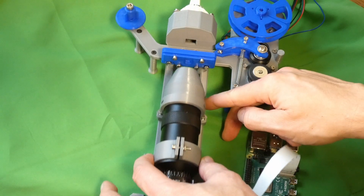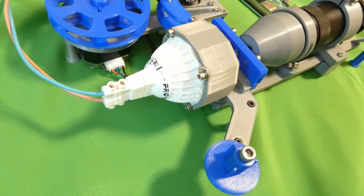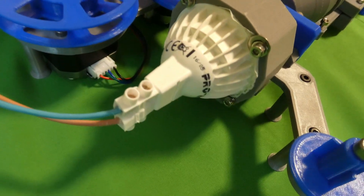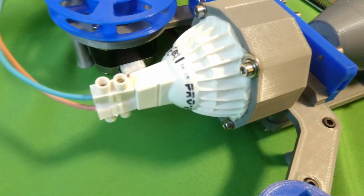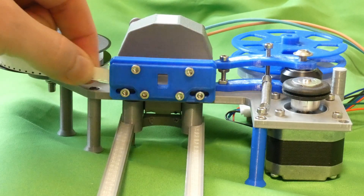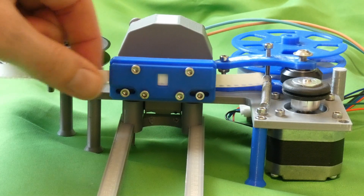Here's the completed setup. The camera sits in a sled which can be moved around to focus and align the image, and then the screws are tightened down to lock everything in place. For the light, I've kept the 12 volt LED bulb — it's a 5 watt MR16 style. In front of the light, I've put several sheets of white greaseproof paper, which gives a good diffused light. I suspect this would be better if I had a proper light diffuser gel or plastic sheet. We load a film on the left hand side with the sprocket hole facing down towards the table, fed into the gate window and out the other side. The film is pushed through the pinch roller, and now you're ready to start scanning.